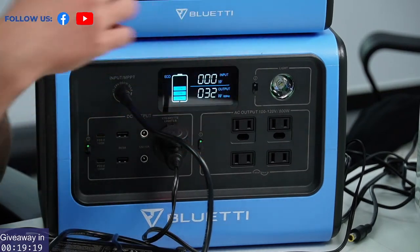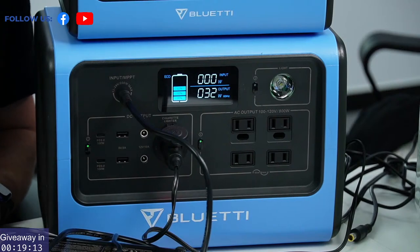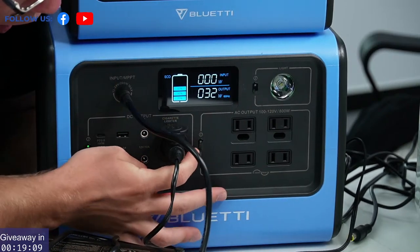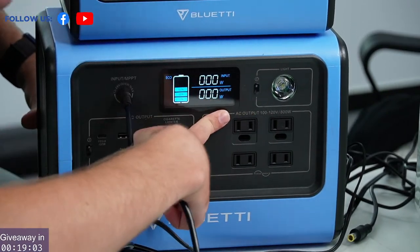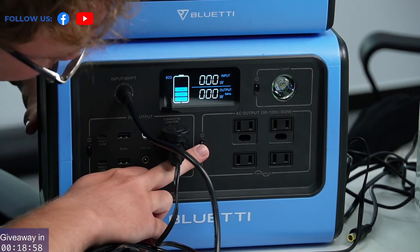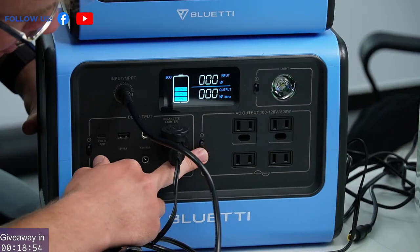Here we have hertz or frequency, 60 hertz. It's either 60 hertz for America or 50 hertz for Europe, the UK, some parts of Japan, etc. We can enter a settings mode when we turn off the AC and the DC right here, and then long press AC and DC. This number, 60 hertz, can be changed. When we press this button, we can change it to 50 hertz and 60 hertz. We keep it 60 hertz.